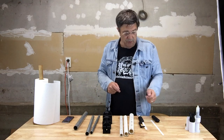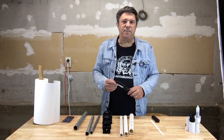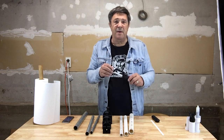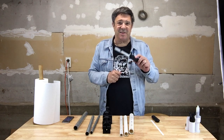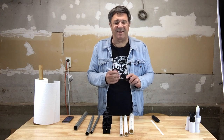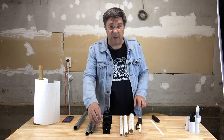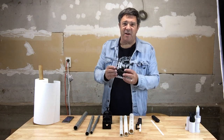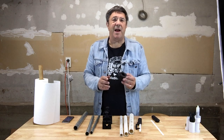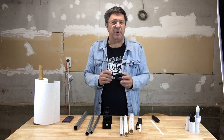However, if you're using a mini hacksaw handle, then a miter box isn't very practical. The sides of the miter box are quite often so high that the blade guide hits the top of the miter box wall long before the blade even makes contact with the work. So what we've come up with is a clamp specifically designed for cutting with our mini hacksaw handle or just a hacksaw handle itself. And it's simple to use and simple to print.